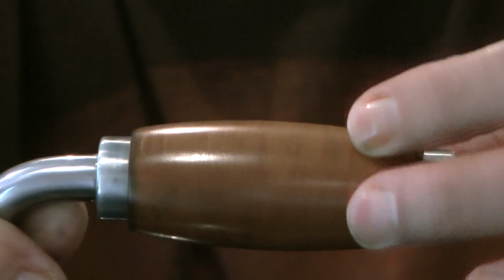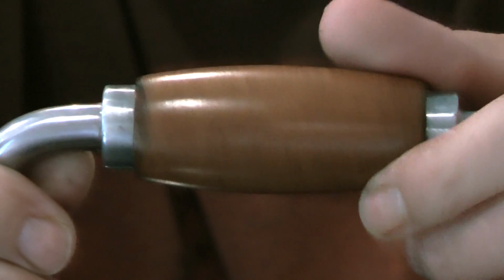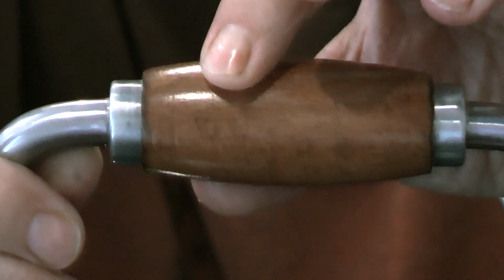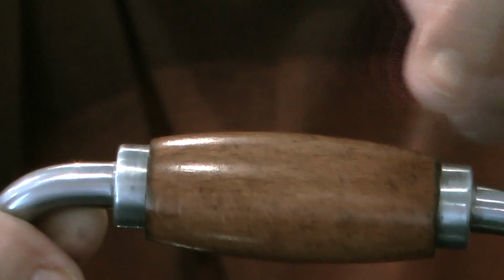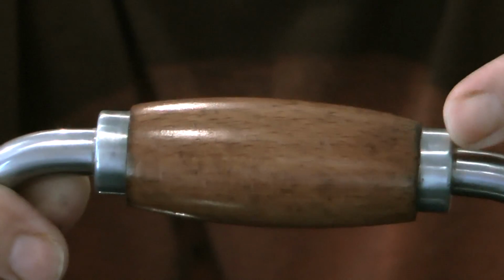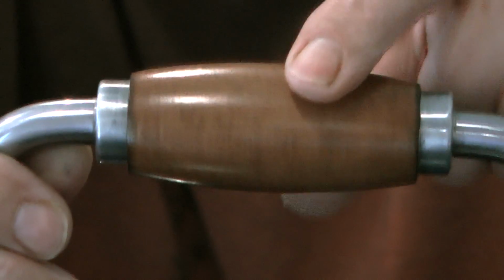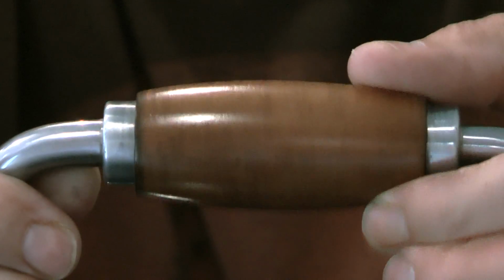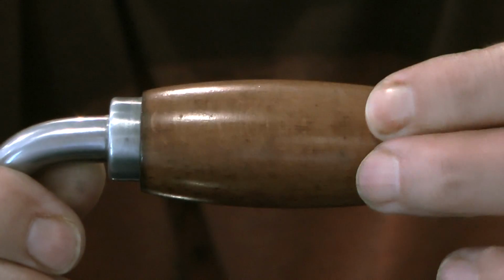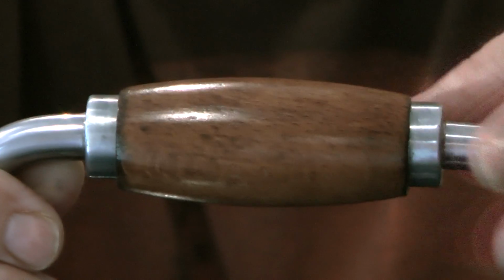This is constantly rotating as you use it, so you're bound to get a little bit of wear on the inside surface. And a little bit of play is okay. And what you will find is if there's play in this direction, when you remove that by moving in the end caps, it will also sort out the play in this direction a little bit. The last thing to check is that it rotates freely, it doesn't catch at all. And as long as all that is okay, then we move on to the head.